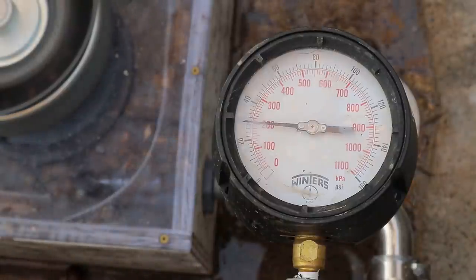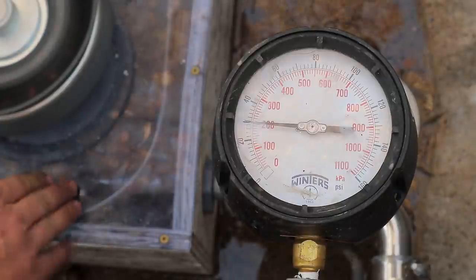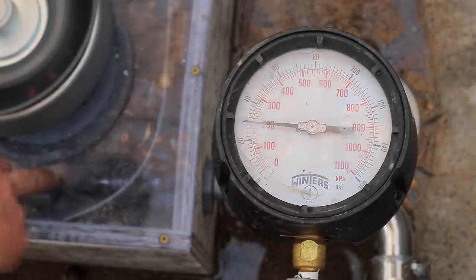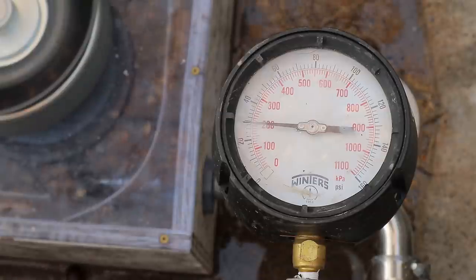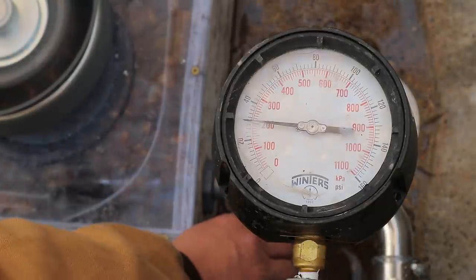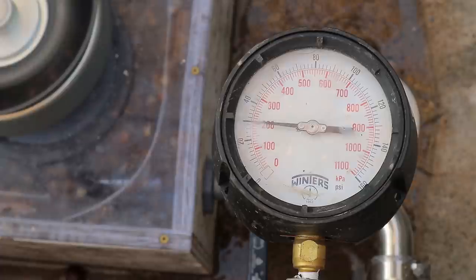Here's a good example of a serious problem that I have with this system. If I have both jets open — or when I have four jets open — it'll outstrip the supply of water from the spring. So what I have to do is run on fewer and/or smaller jets. If I shut off this jet, we're going to see how the pressure will hopefully climb over the next few minutes, because we're only running on one jet now.